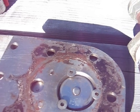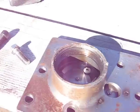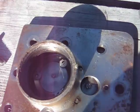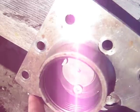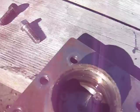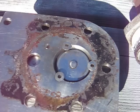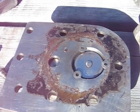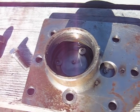This particular head is made out of 3/8 inch thick steel, though I think it could be done with a quarter inch. The way the exhaust valve is inset, there's a taper, so you wouldn't have to make it quite this elaborate. A friend of mine made it — he's a really good machinist, so he had access to equipment I certainly don't have. A person could simplify it a bit and still have it work. This particular one puts out 125 PSI.